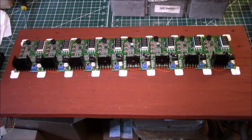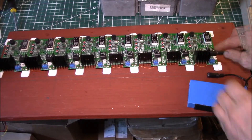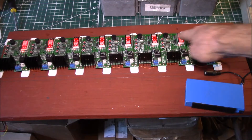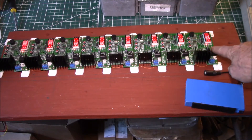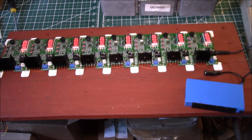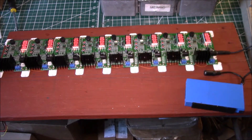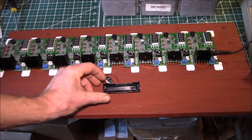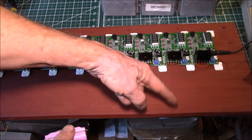I've got my 12-volt battery here — it's a 5.5 by 2.1 mm power jack — and there we go: displays on all eight units! I measured the current with eight discharge modules running and it's about 220 milliamps at 12 volts, so roughly 30 milliamps per unit. Up on top I'll put a little voltage checker so I can check cell voltage before putting them in the discharger.